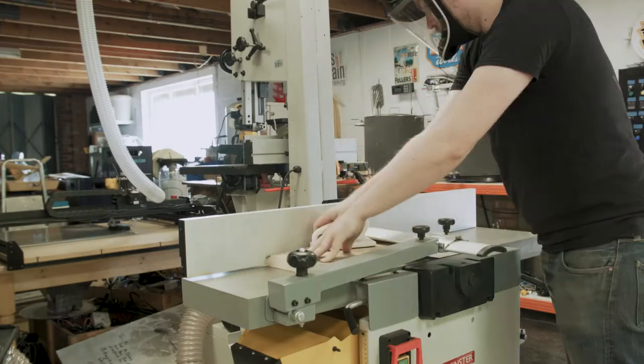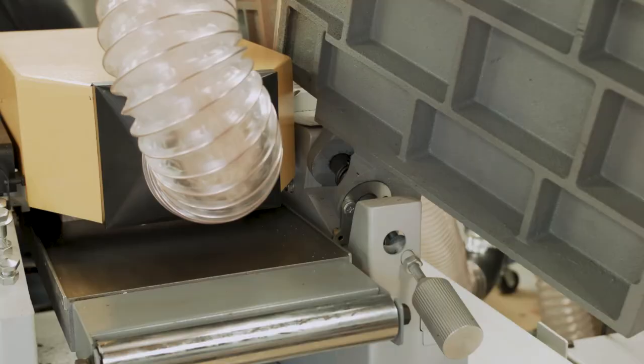After that, I use my planer thicknesser to make the faces parallel and smooth. So, I finally cut this down to rough dimensions. Still needs a bit of a tidy up. And what I originally wanted to do was to cut this in half and then use domino joints to stick the two parts together, what's called a book match.